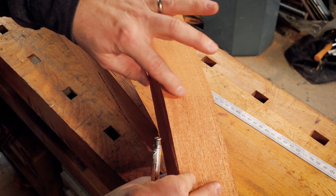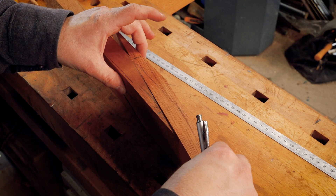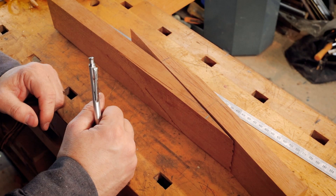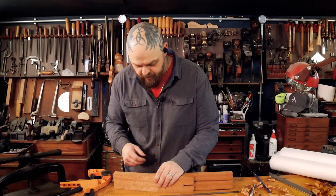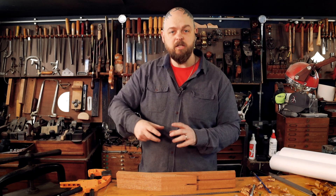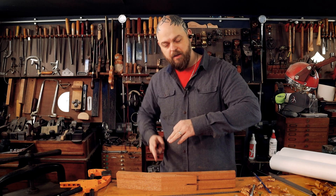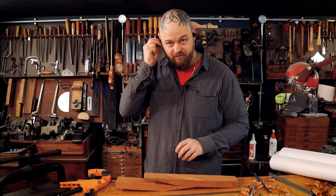The back is the important bit — that sets our angle. This is going to be where we clamp it up and glue. I'm going to do that section of the neck to clamp while I do my cut. I'm just wide enough for the headstock — it's a relatively small headstock. I also want to install locating pins so that the whole thing doesn't move when I clamp — and by locating pins I mean toothpicks. It's all we need: small drill and a toothpick. I'm going to put them on either side of where the neck is going to be, so they're carved away when I cut the neck.